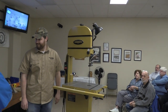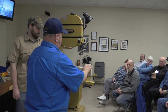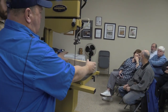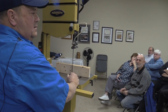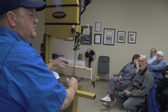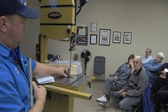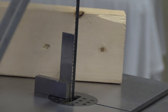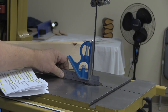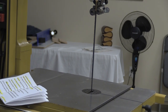There are other ways to test squareness. You can run the blade into a two-by-six — actually something taller gives you a better reference. Run it in there, then come around the back side the same way you do with a scroll saw — it should fit the same way inside, confirming you're level with the table. Using a square is really the best method, but on some smaller bandsaws you don't have room. You can also take a level and put it against the blade to tell if you're perfectly square. Use whatever method works for you.